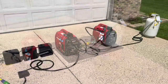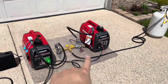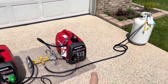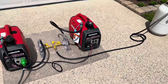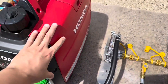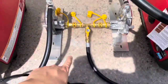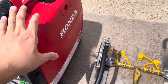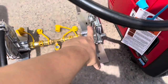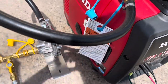I just went ahead and started the generators, so they're all warmed up now. When you purchase our hose extension kit with the T-splitter, you'll want to purge the hose first when you start it — it takes a while. Have this disconnected with the valve turned on, and start the first generator first. It's going to take a couple of pulls because the line has air in it. Once you get the hose primed with propane, the first generator will start. Then connect your second regulator to the quick connect and start the second generator.